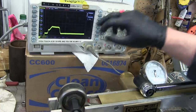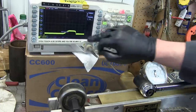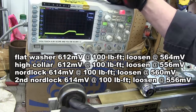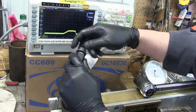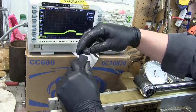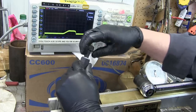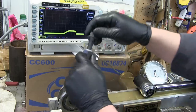Here's the second test: 614 to torque it up — same same, only different. And then this guy: 556 millivolts. Wow. I wonder if it's something to do with the fact that this is flanged and hard, and this nut is not mild steel. The Nord-Lock might need to bite in, which also invalidates our test of the spring washer. Well, that's interesting. When you get a result that brings up more questions than it answers — that's proper citizen science right there.